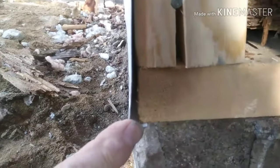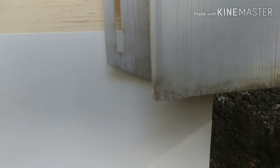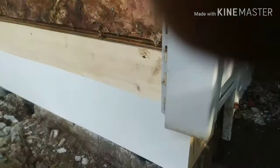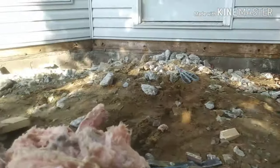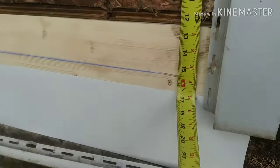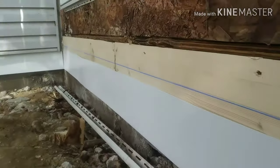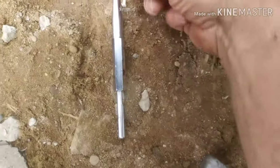After that, I bent a piece of flashing to fit — I tried to make a little drip edge on the bottom. After it's all done I'll go back and caulk everything. It gets up under the siding an inch to an inch and a half depending on where you're at on the house, but I couldn't go up too far without pulling the siding off everywhere. I did measure to the top of the J channel before I took it off so I could put it back where it was — snap a line there and the J channel will hang down onto that flashing, then we'll put the siding back on.